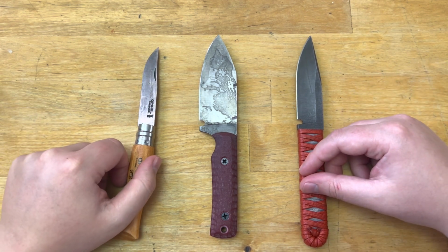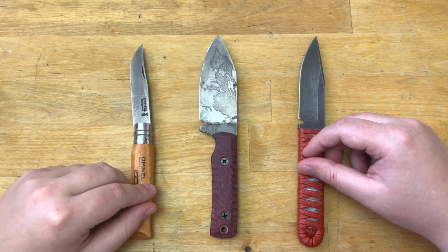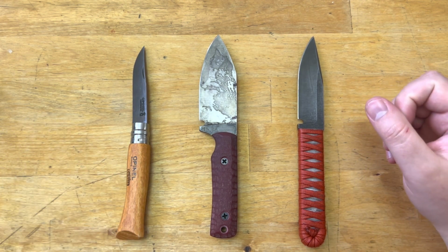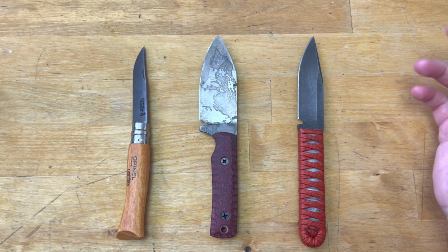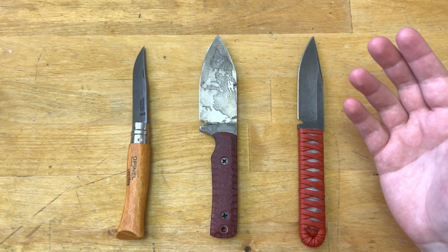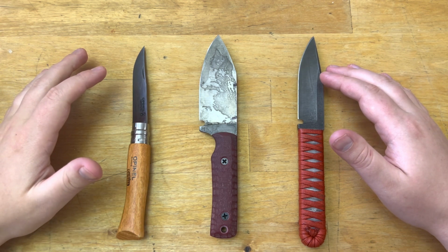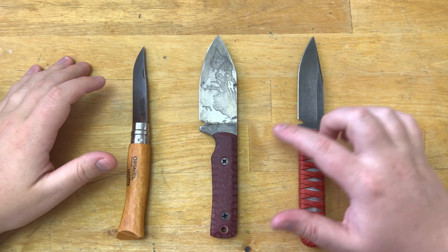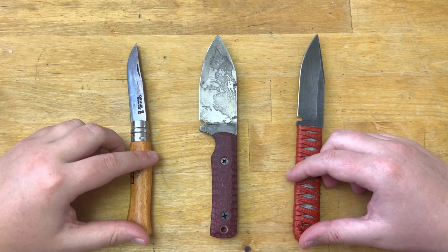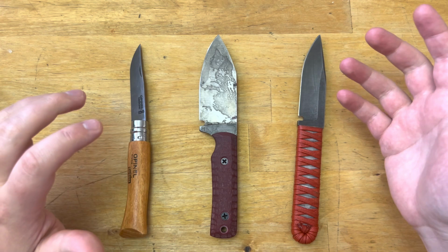And a lot of people are afraid to let the carbon steel do its thing, you know, and let it patina. Now, rust is one thing, but if you take care of your knife, you dry it off after use, you could maybe even oil it, or just something to control the rate at which it oxidizes helps. But also just using it. There's something about just using it versus just letting it sit, to where it tends to get the magnetite and not the ferric oxide, or ferrous oxide is what I should say. Magnetite is this darker patina that you're seeing, and that's what's desired.